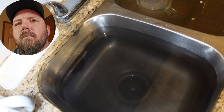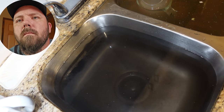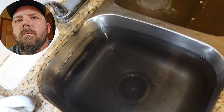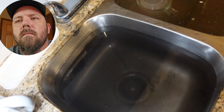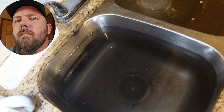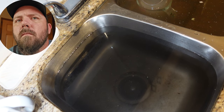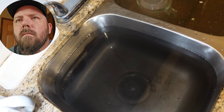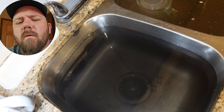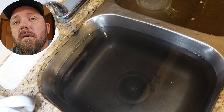I don't know if I've done work this year or even within the last six months on this line. Usually it's the end units because they're back-to-back — so it'll be two kitchens on one line. That's what I thought it was here. But I didn't realize we were connected to the bathroom side, and that's actually surprising because if this is picking up the bathroom line it's tied in with the toilet line. That's fine for draining, but when you get grease buildup — so I thought it was back-to-back kitchen lines but apparently it's a bathroom and a kitchen backed up.